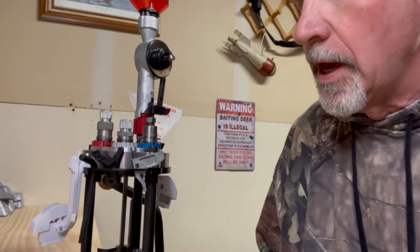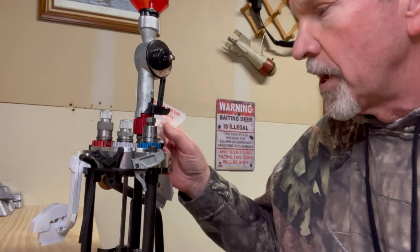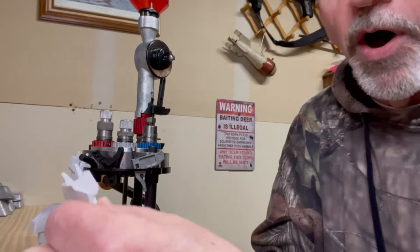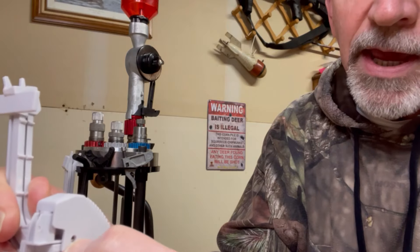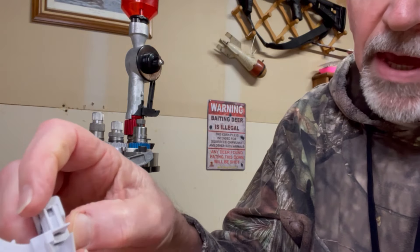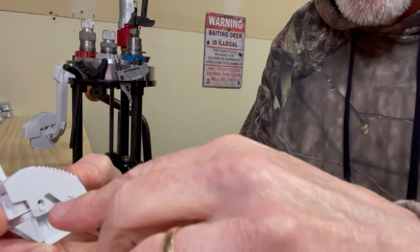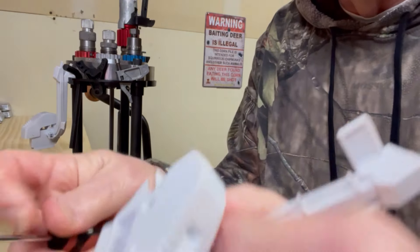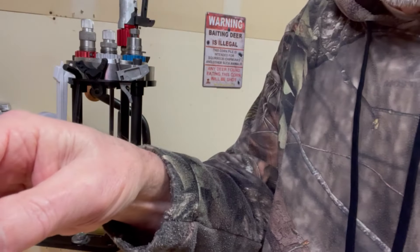And I mentioned there was a fix, and I even referenced a video on it — I thought I would just show you how that fix is done. I'm going to do that with this. First of all, I'm going to take this top off. Then the way to do this is — you've got a little button here on this side, you can see — and you have to push that in at the same time as you pull the whole trigger assembly back. You might have to get something to push that in — this is a small screwdriver.